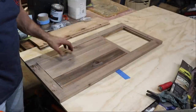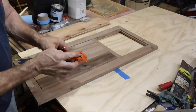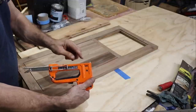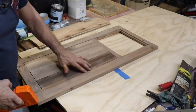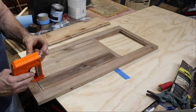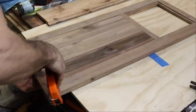Because it's tongue and groove, when you load the nails in the Unitacker, they're not going to be in the center — they'll be close to the end. On the bottom side it tells you where to put the nails; they go on the right side. So when I'm shooting this I want to make sure the right side is over the groove and not the center where I want to go. And it easily nails this down.